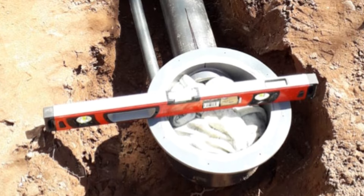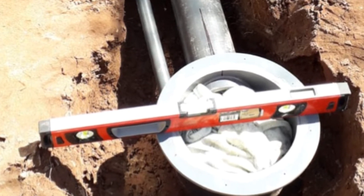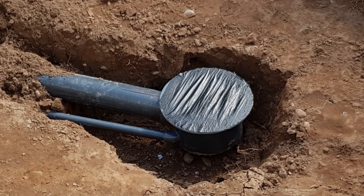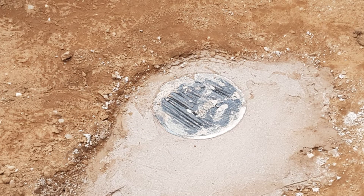If you look at this picture you can see a smaller pipe to the side of the 4-inch pipe — this is for the air. I also taped over the opening for the bottom drain just to stop any debris falling into the drain and getting into the pipe, so as I fill it with water it won't go straight into the filter and cause a blockage. Once I was happy with it I set it in concrete to give it extra stability and a firm base.